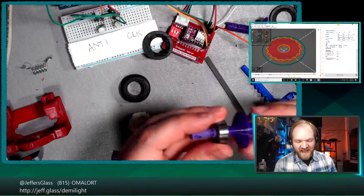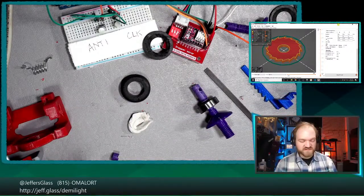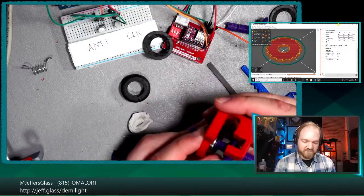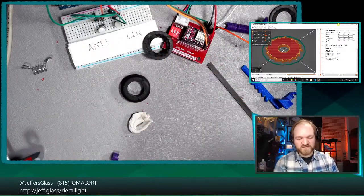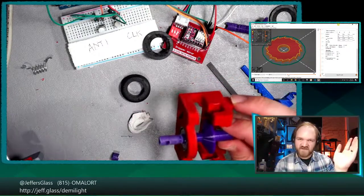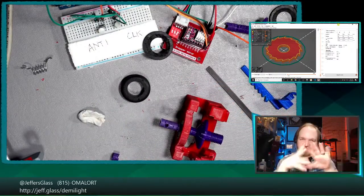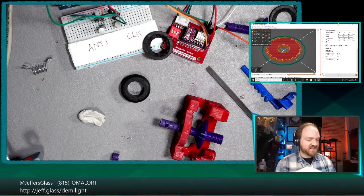But one of the things I was adding to the end of this project was a couple of utility features in the control room next to the computer, like a nice toggle switch, a little beep, doop, toggle switch, rotary switch on the rack where the computer is that just applies and removes power to that RS-485 converter. Just so it's really easy, like if you're working on the computer and you want to test out some programs, but you don't want there to be any way for signals to get from the computer to the actual plane.